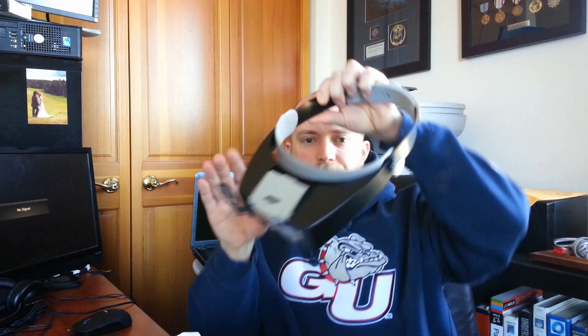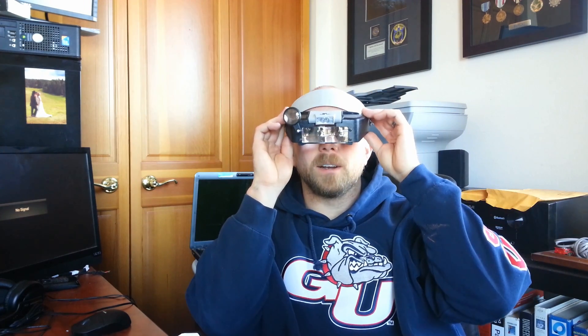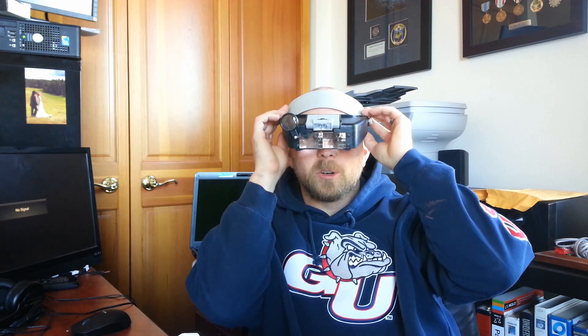I am totally geeking out here. I got my magnifying glasses out and looked at the die on the crimp tool. I figured out that there are little teeth that punch up into the connector — you have this action where these teeth punch up into here. What was happening is these teeth were offset, so they weren't connecting correctly. A lot of you pointed out that that might be a problem, and sure enough, that is where we're at. The crimper and the connectors are just having a problem.